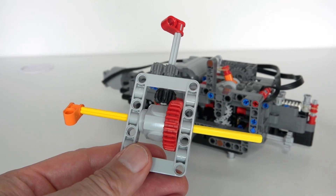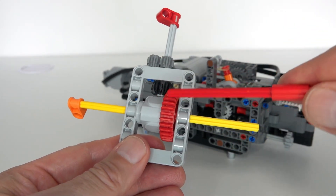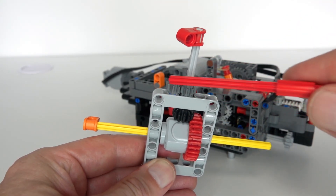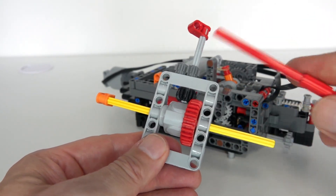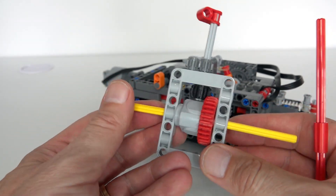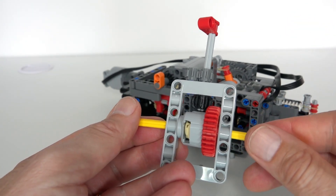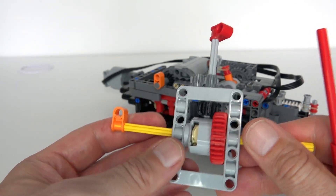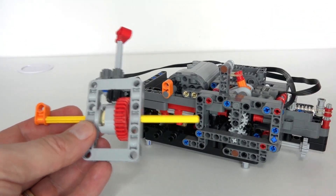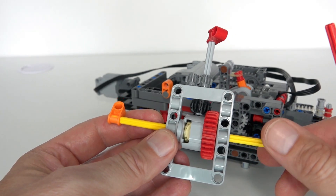The way the torque detector works - we've got the motor on the right driving the output on the left. Coming off the differential is a small 12-tooth gear, connected to smaller gears that have some resistance on them. Because there's resistance on that, the main driving path is straight through. But as soon as there's loading on the output, the output on the side will start rotating - that's the idea of the torque detector. As loading appears, it rotates and drives the gearing that drives the electrical switch, changing gears depending on the tension set in the mechanism.